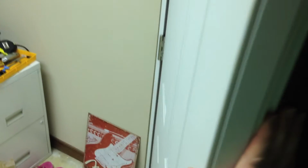We start with the steel door here. All important, keeping some of the noise out from the rest of the building. Got a layer of drywall glued here with Green Glue, which is supposed to be soundproofing glue, or at least aiding as a layer in soundproofing. So we got steel, Green Glue layer, and drywall. It's just regular 1/2 inch. Acoustic foam is not soundproofing by any means.